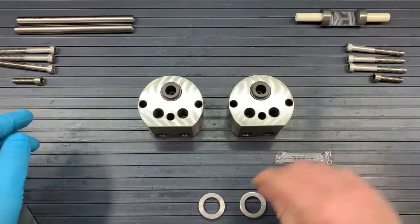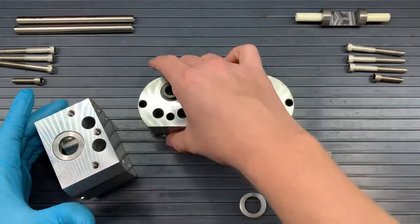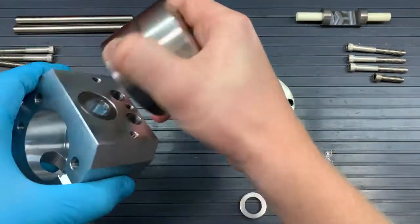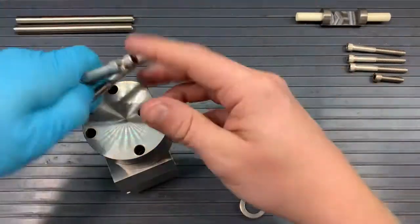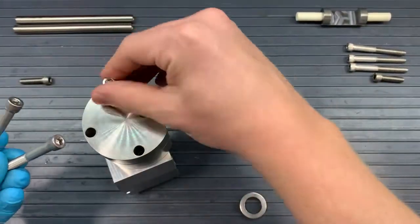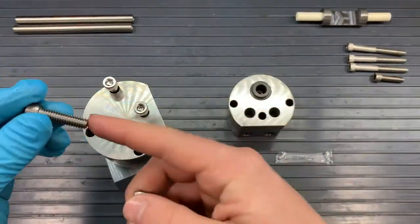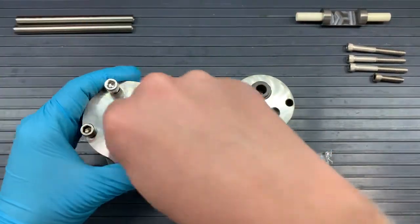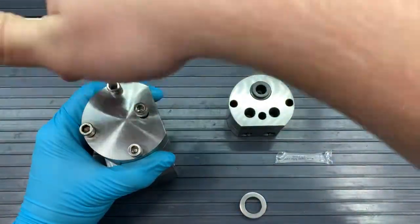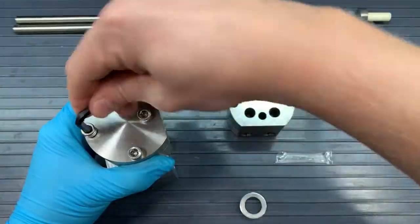Before we put our sub-assemblies onto the crankcase, we want to make sure that our steel washer is in between the crankcase and the stuffing box. Put the correct sub-assembly onto the crankcase so that our inlets and outlets are in the right position. We'll grab our four bolts from each side — three of the bolts are a different length than the shorter one, which is only an inch. The shorter one goes on the top round edge of the head, and the three longer ones go in positions one, two, three. The shorter one will connect the stuffing box and the head together.